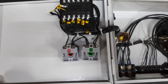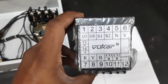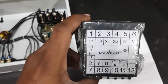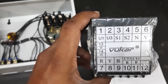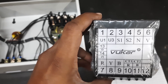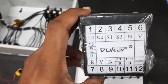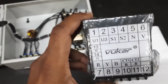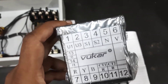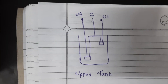If you are using a water level sensor, you need to use U1 and U3, which are terminal numbers 1 and 2, and L1 and L3, which are terminals 13 and 14. With a water level controller, you only need to use terminals 1, 2, 13, and 14. For other applications, you don't need to use those terminals.